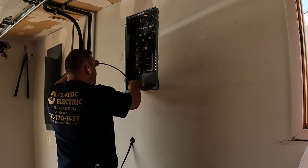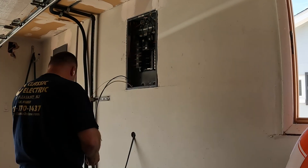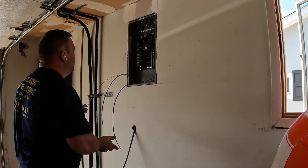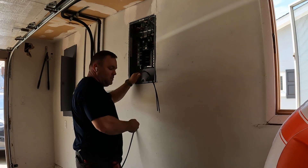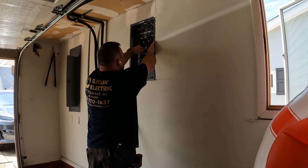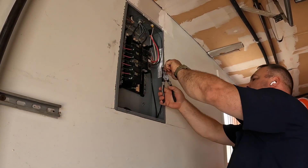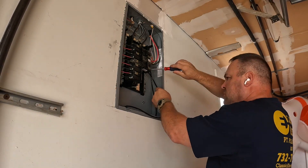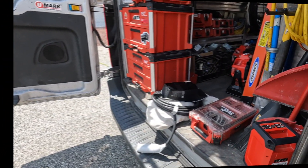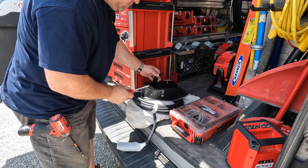This section of the video is in time-lapse mode. What I did here to get my wire to the bottom of the panel without doing any damage to the sheetrock around the panel was I attached the Romex connector directly to the wire and pushed it up the wall — which didn't have any insulation — into the bottom of the panel. I took out a KO seal, put my lock nut around the connector, and now the 60 amp circuit is in place, terminated into a double pole 60 amp breaker.